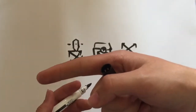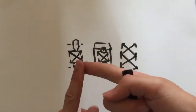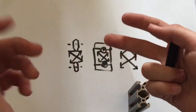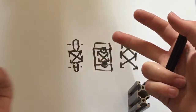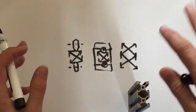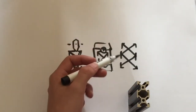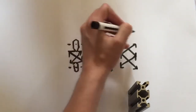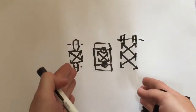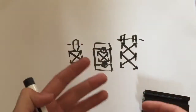Compared to basically the spindle, the huge motor, like a drill-like motor, that cuts the wood or the material, plus the Y assembly to move it, plus the Z assembly to move that and all that. It's just a lot of weight. So what I'm using instead is a bearing system that uses 2 bearings at the top to take downwards load, and that should be the majority of the load from the mass.